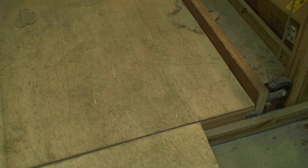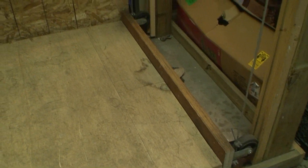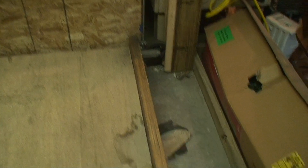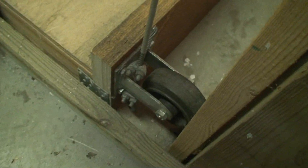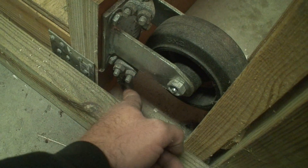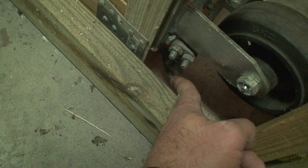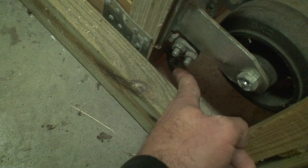The platform uses 2x6s, and I've used some 10-inch LVL lumber for the main carriers, with 2x6 joists hung off that every 16 inches on center, and a three-quarter inch plywood floor. I fastened the casters and bolted those through. And then I've got a through-bolted eye hook here — I can't think of the name of it right now — but that's where my cable fastens to.